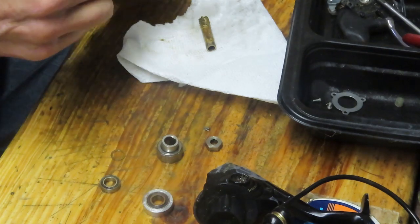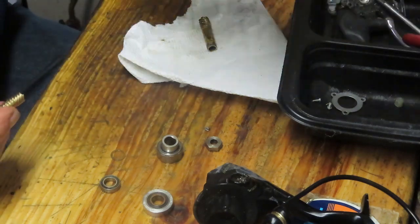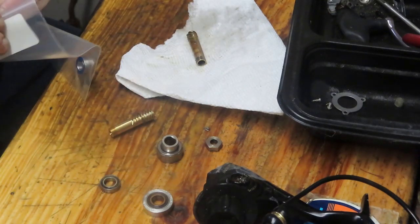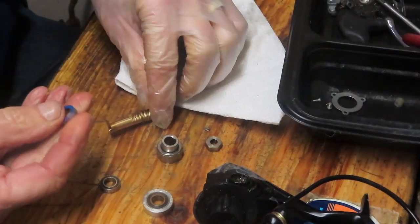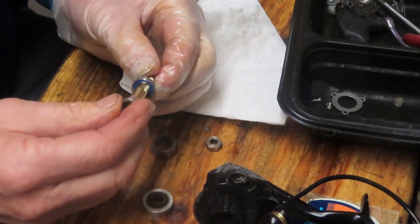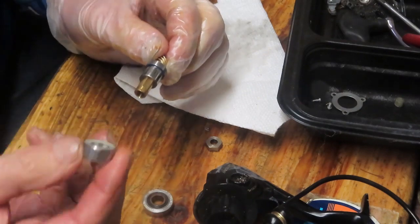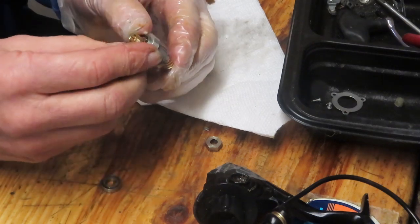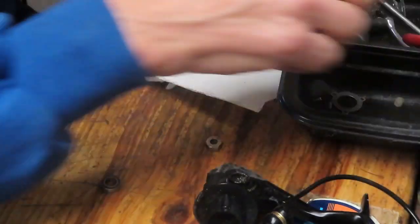We're just mopping these up. I did not find any issues with these parts when I tested, so we're not going to put the old back into the new. Notice that there's a shim washer on the bottom here. Let's go into our basket and find the replacement pinion gear so we can rebuild this stack while our memory is still fresh. The collar goes on, and then the anti-reverse clutch — it's a friction-driven device and it needs to be dry to work effectively. Then we can put our top piece on. That's ready to reinstall once we grease the bottom.